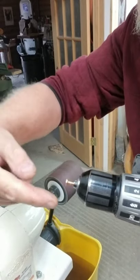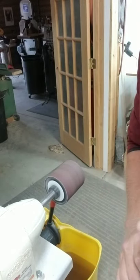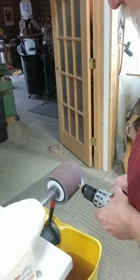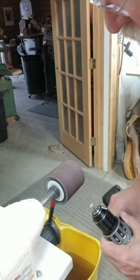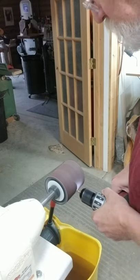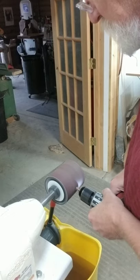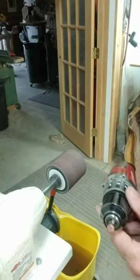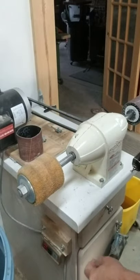You can see that it's got a bevel going back toward the stem of the rivet. Now I'm just gonna deburr it. It's also cleaning it for the soldering, so if you don't touch it and get it oily from now on, you'll get a good draw. I do have a Scotch-Brite wheel over here that's handy for cleaning up and taking the burr off.